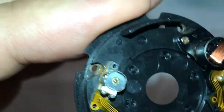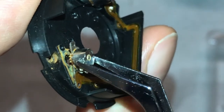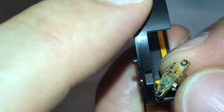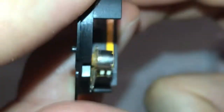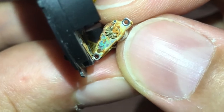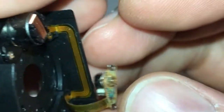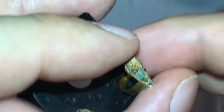There were two little screws on both sides of the little electric motor — I unscrewed them and see that it is all rusted. There is a remarkable amount of rust. The motor is connected to the camera's processor with a strip cable, so I need to be very delicate here. You can see the little gear and the metal base of the motor. It's quite a tiny motor, and I think it's a stepper motor because it doesn't have two poles — instead it has four poles.